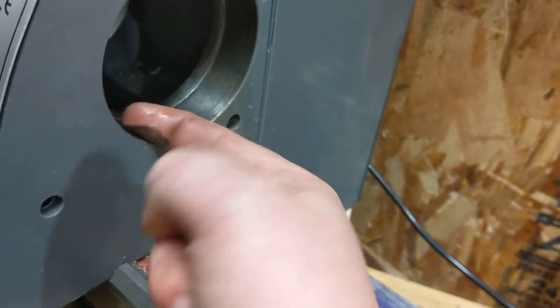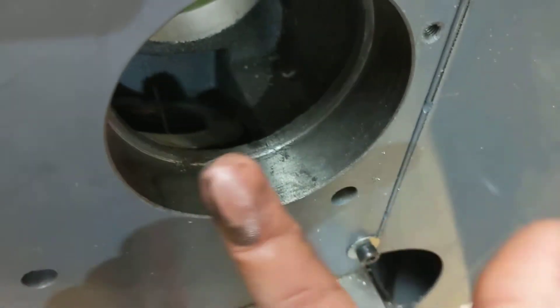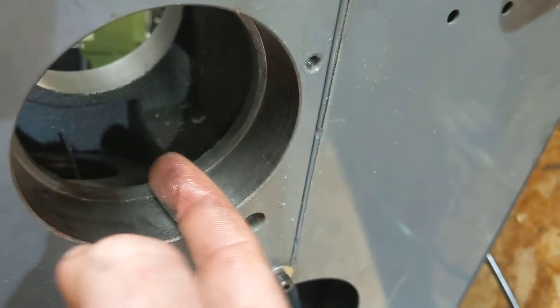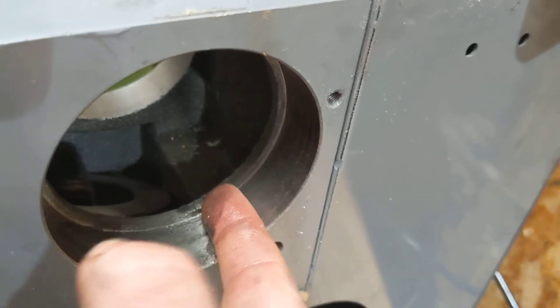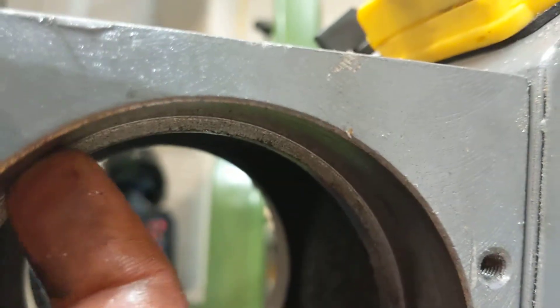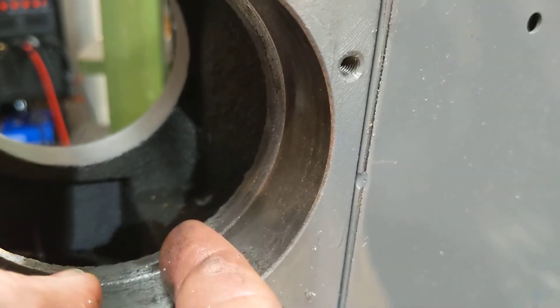You can hear it — there's grinding dust caked in there. There's a lip here on this bore so the bearing race has got to seat against something, but there's a giant burr on this side. On the front side there are no voids in the casting, but on the backside there's a huge void in the casting. I had the same burr all the way around this bore.